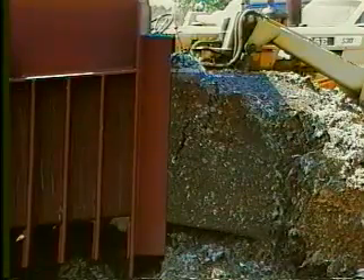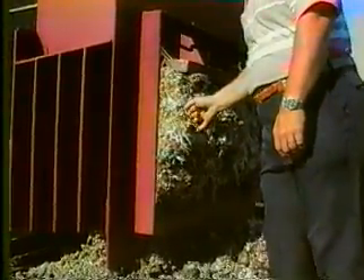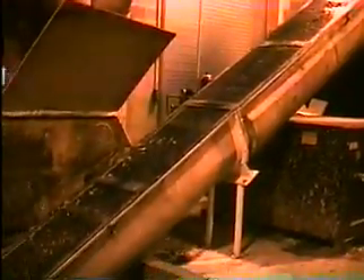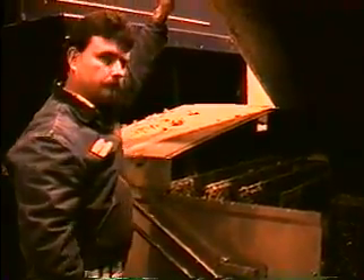High-density extrusion leaves products in a very solid concrete-like state as it exits from the extruder. Independent testing on wet waste drains have shown product solidification of up to 60% and an average annual savings of $125,000. A stainless steel screw conveyor at this paper mill feeds the secondary fiber rejects into the extruder hopper. The extruder in actual operation has a liquid deflection shroud. The extruded liquid is channeled under the extruder and then routed for either disposal or recycling.